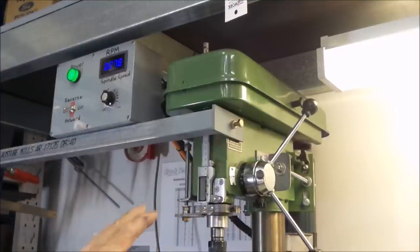There is a flywheel on the bottom of this treadmill motor that I'm running with it at the moment. I've run it with and without the flywheel. It seems to help a little bit as far as adding mass. I find the flywheel that's on there is particularly handy when you're using a hole saw cutter. It just adds more torque and puts more fight against the cutter.